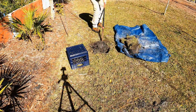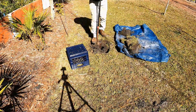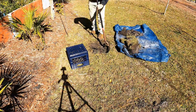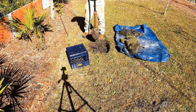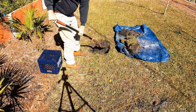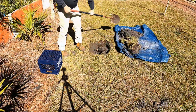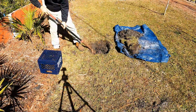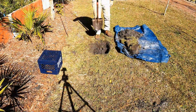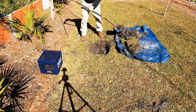I've been doing a lot of research, watching a lot of videos from around the world, and in places like Europe, Australia, New Zealand, this is very common practice. Although they don't show the results of the soakaway, it looks like a great project for the do-it-yourselfer, and we're going to put this to the test today. The soakaway is used in places where you cannot send your water to the street. Some people call it a dry well, but it really is more of a soakaway because it's going to soak that water from the low spot down through the gravel into the hard pan below.